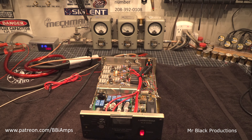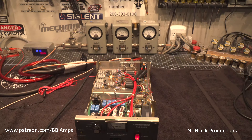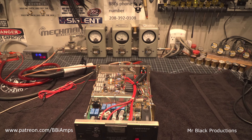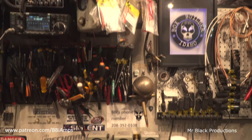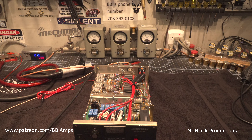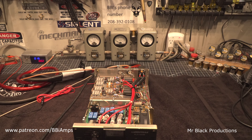Let's go on up to 20, right in the middle of the 20 meter band — 500 watts. Let's come up to 15 meters. 21.3, at 80 watts of drive going in, 500 coming out.